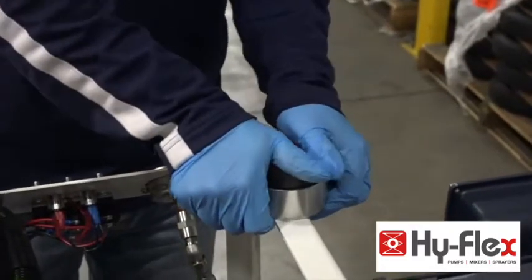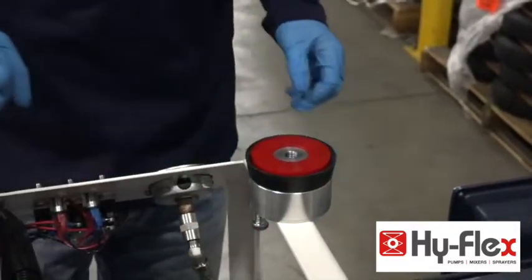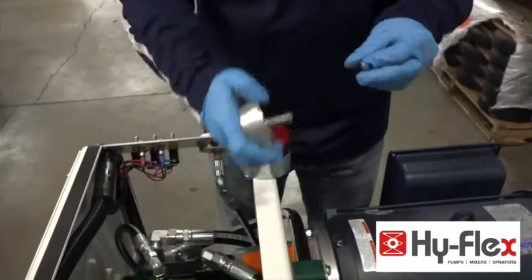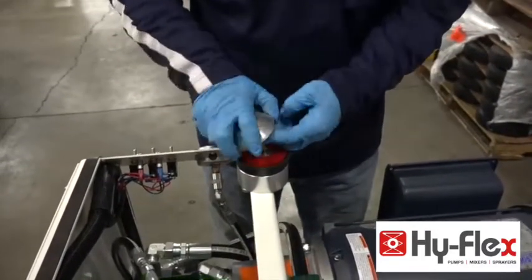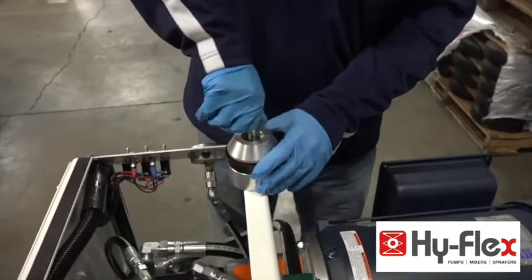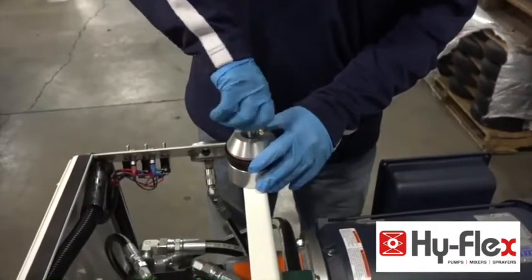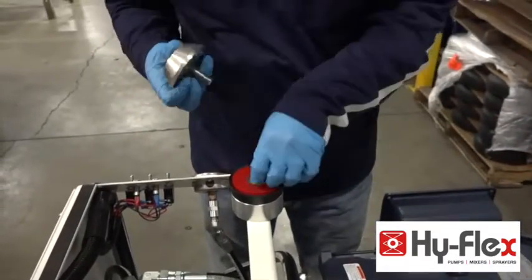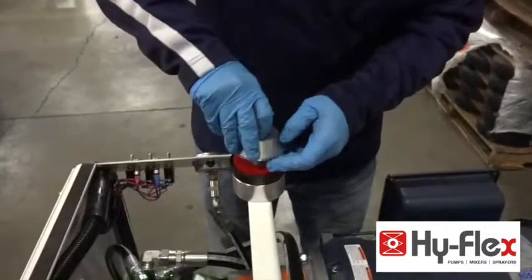Place the body back on the piece of equipment. Install the expander ring and piston cup. Install the shims under the piston face without the lock washer. Start with 9 shims under the piston face. The shims can be a little difficult to get past the bolt, so be patient.